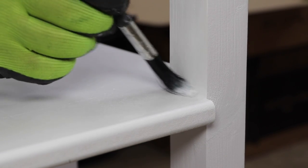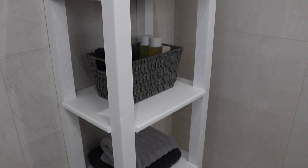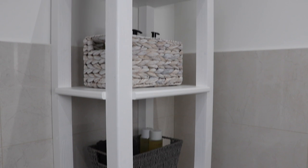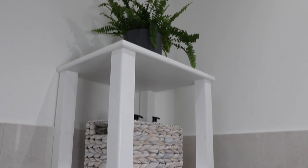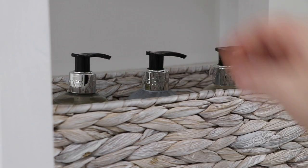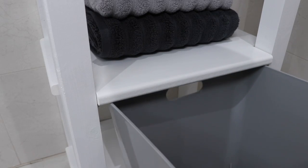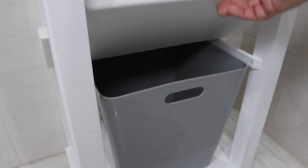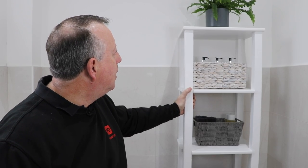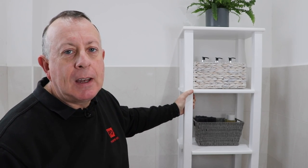With the glue cured, I can now touch up the areas that I over-masked and give the whole unit another coat of paint. There you go - complete, painted, paint has dried, and in position, and I think looking rather nice. I'm really happy with the joints and that comes from having a mitre saw that's set up properly and making sure all your measurements are as accurate as possible. I really love this way that I can still see the grain of the timber, although it's properly painted. And I think it's quite nice to be able to have a bin that isn't just on view. It's come out better than I expected, and when I try to rock it, it's not going anywhere - it's probably twice as strong as it needs to be. So I'm not putting those dowels in. Looks like I managed to get away with it.